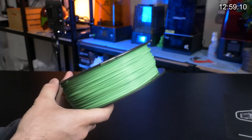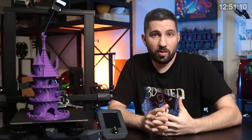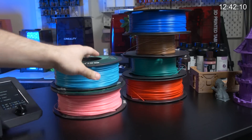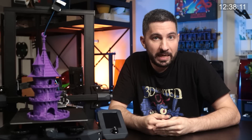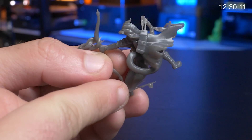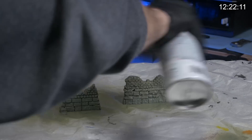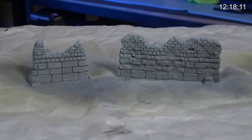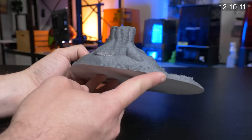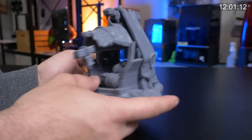Filaments come in all colors, finishes, and prices, and I recommend finding one that you love, that looks good, prints reliably, and is priced at your price point. Some folks want as cheap as possible while others will pay more for higher end filaments. YouTubers like me try a whole bunch of different filaments and resins because we want variety instead of the normal sea of gray, but you don't have to, especially if you're printing for tabletop games. I like printing in gray because it allows me to easily see any issues in the print quality before doing any painting or post-processing, and this is true of both resin and FDM prints. Quick tip: if you want as minimal work as possible when painting big terrain pieces, print in black and then spray the highlights over it — this eliminates 99% of your work and adds natural shadows. For minis, print in gray so if you miss an area it won't stick out like a green or blue resin color would. My favorite PLA is ESUN PLA Plus gray.